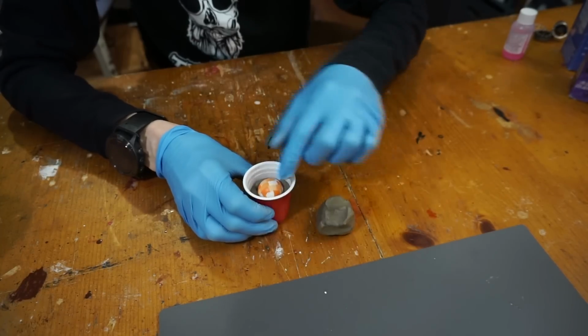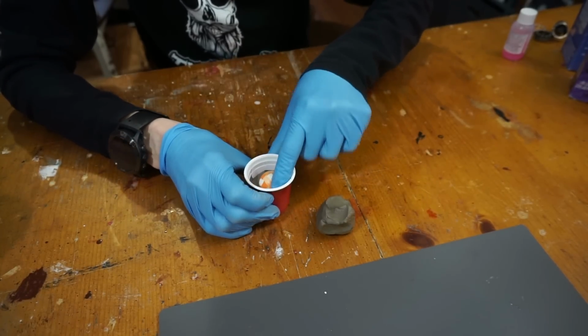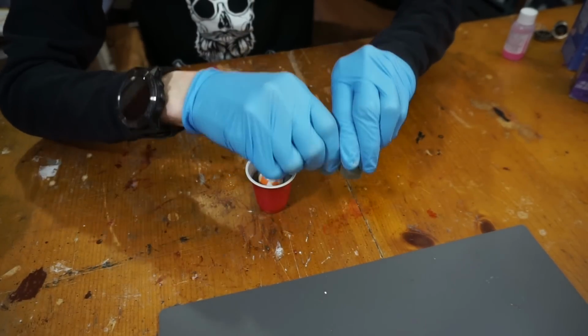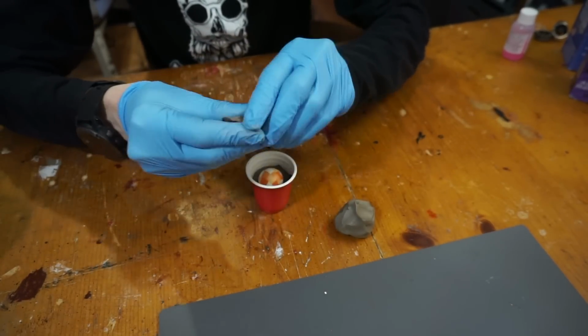This is just regular air drying clay, the cheap kind. I'll put a link below. Just make sure it has no sulfur, because that will inhibit the curing of the silicone. Then you end up with a goopy mess that never cures.